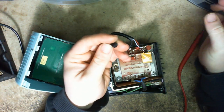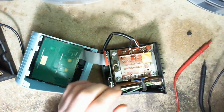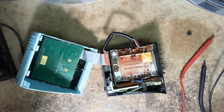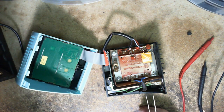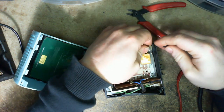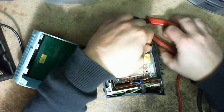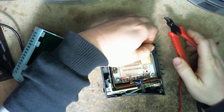Found a 4-amp, 250-volt replacement fuse. It has a black casing, but that's not going to matter. Slow blow or fast blow — I don't know, we'll find out. If there's something still shorted or blown in here, that fuse will just pop out again. Otherwise, we can just sacrifice that fuse. I'll set my iron to 600 degrees and grab some side snips. The lead on this fuse is stupidly long, so I may have to snip one side and desolder the other.